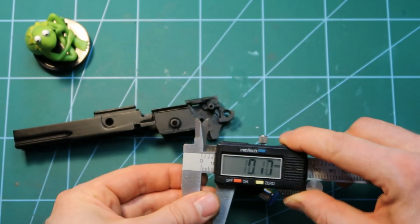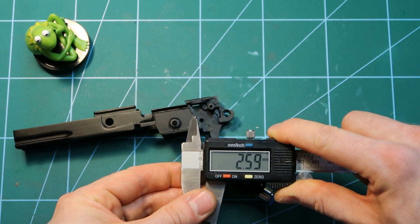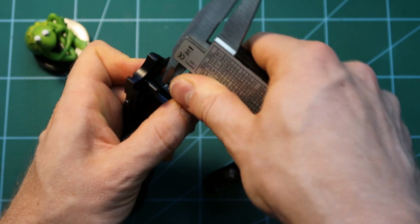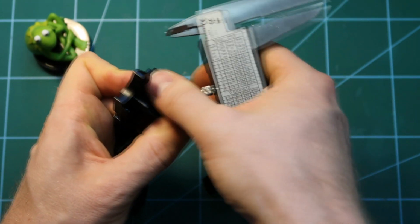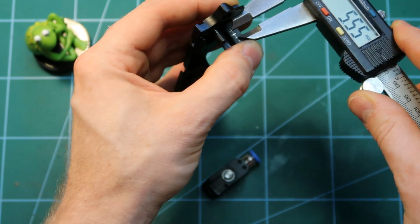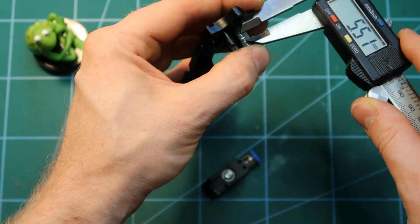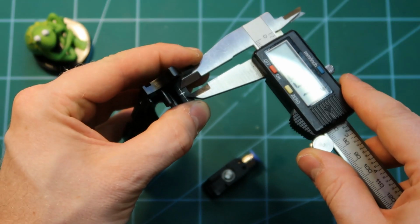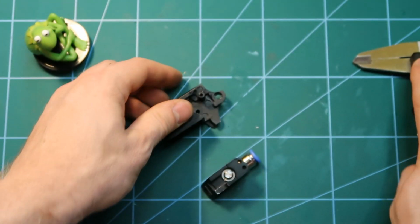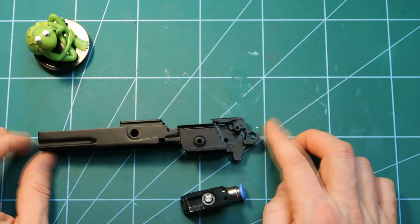Now I set my caliper to 2.75, make the symmetrical marking. Side, I can do it also with the rear, if it is easier. So now you can see I have my three lines, and if I measure in between the lines for the screws, it should be 5.5 millimeters more or less. It will never be perfect, but should be more or less, which in my case you can see it's actually quite perfect. Okay, so that's it.